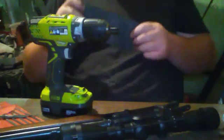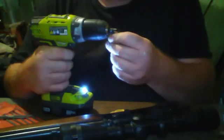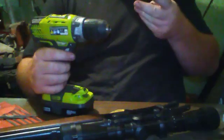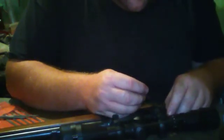Just don't clamp it tight. We're going to go straight to 1,000. Actually, I just got my strips right here. Let's use whatever this is. Good enough. Didn't even booger the head of the screw. Look at that. 1960 steel, baby. Can't beat it. All right, here we go. A little bit of oil. Spread it around. On this, I like to get it on the threads. These threads on these Marlins will stick on you if you don't service your gun regularly. They will stick. Okay, place that down in there. And we're going to throw it home. Okay, that's snug.